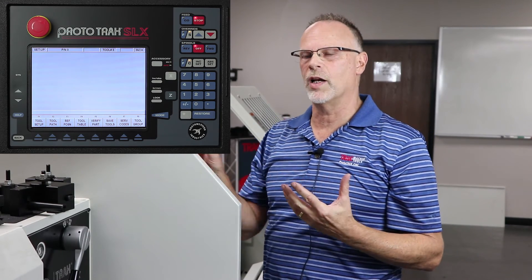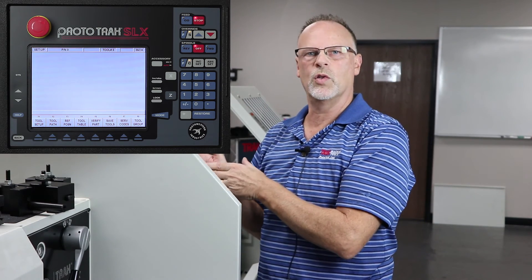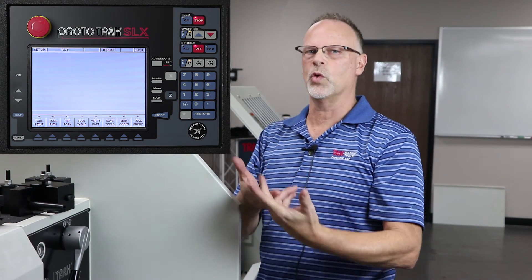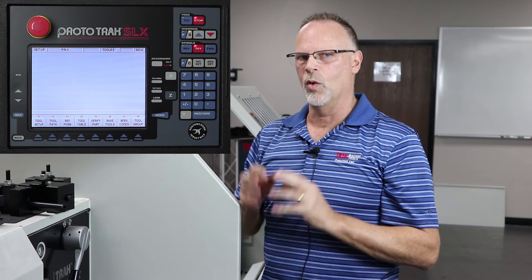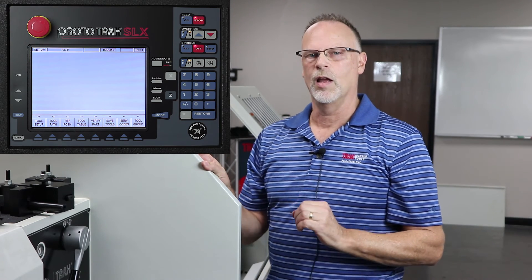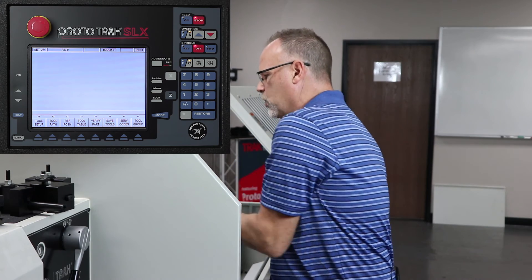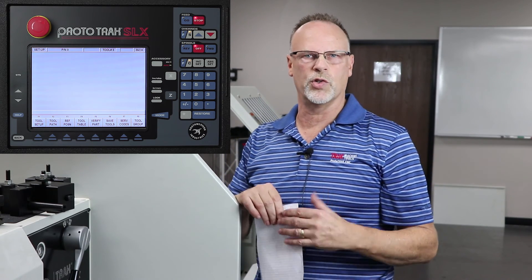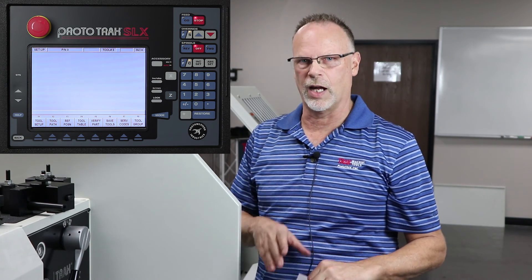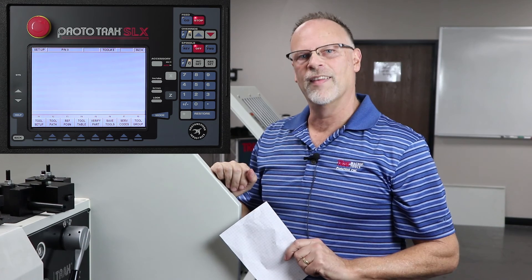Now remember, once you set all your tools up, the next thing you want to do is always hit the return key and go to where it says save tools — that's going to burn the memory of all these tools to the brain of the machine. So if I shut the machine off, I can take any tool that's in my library and touch it off X, touch it off Z, and all the tools will follow. Once your tools are set up, you never go back to tool setup unless you're strictly going to the tool table to make a modification. As far as setting Z zero from here on out, it's going to be set in the DRO mode. So in our next video I'm going to start by showing you how to do drilling and tapping, and then a third segment showing boring inside cycles, inside grooving, and inside threading. If you don't have one of these fancy gauges, make sure you talk to your local rep. See you in the next video — thanks for watching.